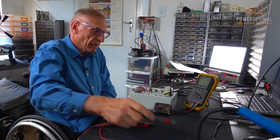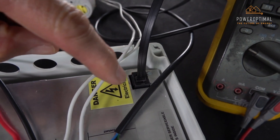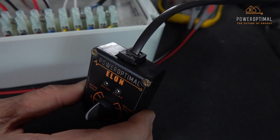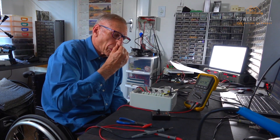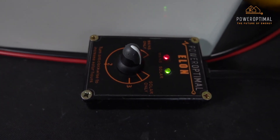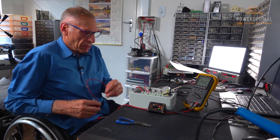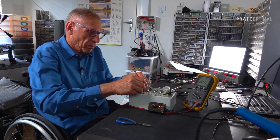Finally, make quite sure that the RJ connectors are connected properly to the Elon as well as into the remote control. If this connection is removed, the Elon will not go into solar mode irrespective of the position of the pot — it will just go to mains heating.